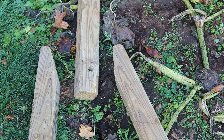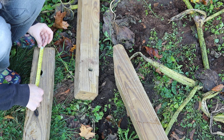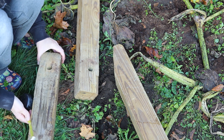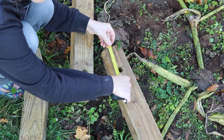If you want specific numbers to guide you, here are my measurements — I kind of made these up as I went along, but if you know an engineer they might improve on them. My biggest pumpkin was 1,593 pounds and the tripod lifted it easily without any sketchiness. The center hole is about four inches down. On the flat side of the angled ones it's about four and a half inches down on one side and about 3.75 inches on the cut side, consistent on both side pieces.